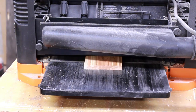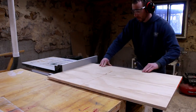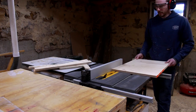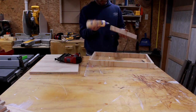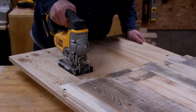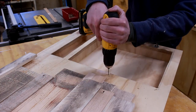As you can see there's a lot of character and surprises in this pallet wood. Next was the start on the hidden compartment storage. This is just a simple box that will be mounted to the underneath part of the desktop. There are two openings — one for the hidden storage and the other for the power strip. I glued everything up, nailed them together, and then added some screws on the bottom. I cut out two openings for the storage using a jigsaw and then mounted the storage to the desktop with some screws.